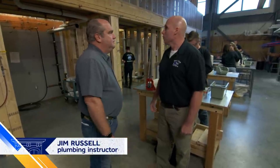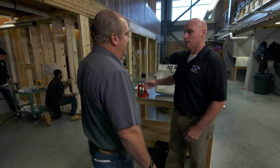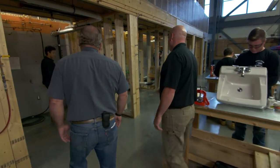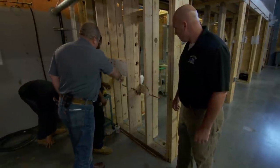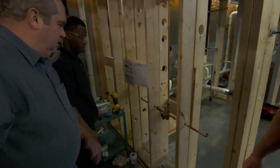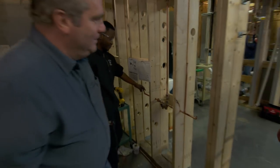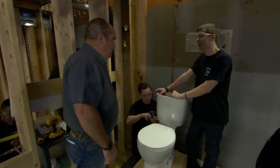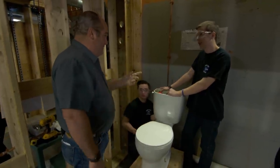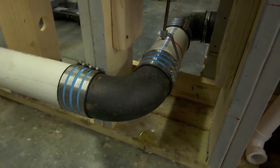Hey Jim. Nice to be here in your laboratory. Take us through what's going on here. So basically, we're trying to mimic the outside world in this shop atmosphere, and we can do all that with these booths. Everything they might find out in the real world. Cedric here is installing a shower valve. So you've drilled the studs and anchored everything? Yeah. It won't make any noise in the wall too, will it? Nope. Good job. These two students are installing a toilet. You guys do the drain work here too? Yes. What do you use? PVC. In the old days we used to pour hot lead — it's a lot easier with PVC. We also have them use cast iron as well as PVC because they need to know how to use all the fittings and transitions.